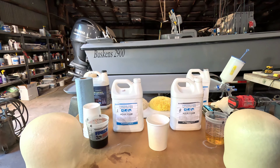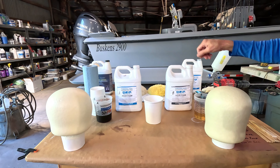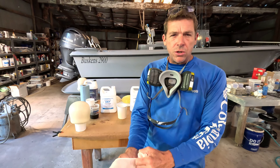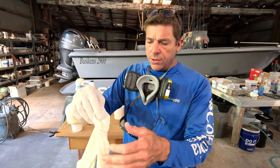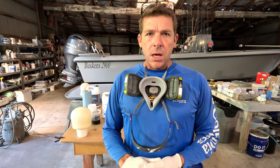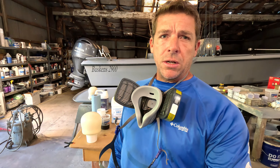We're just going to start off by mixing a couple of batches together and I'm going to pour them in the first one with the vent holes to simulate what we would do if we were putting foam underneath a floor. A lot of folks ask: if there's a problem with water absorption, why do you even put foam underneath the floor of a boat? Why would a manufacturer do that? It's actually required by law. The Coast Guard requires foam flotation on all boats under 21 feet, so we are required as boat builders to put it in those smaller boats.